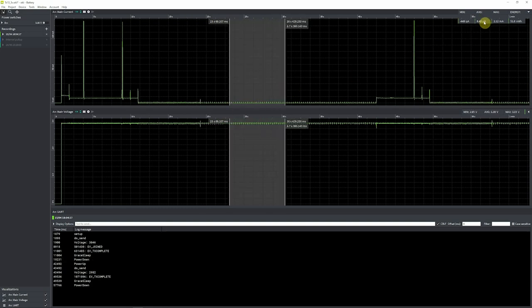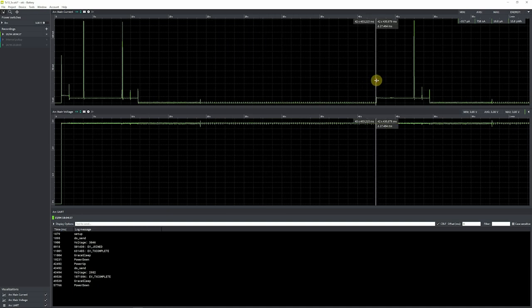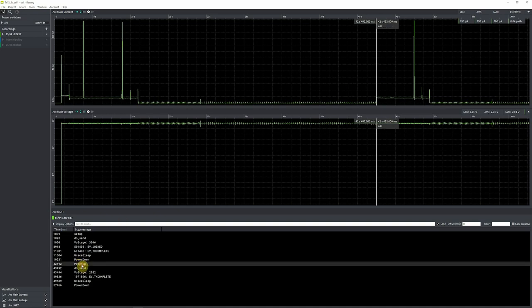This is where we achieve the lowest current consumption, about 8 or 9 microamps. That is pretty good. Now the device will sleep until the microswitch is activated or it hits a falling edge. This is what I triggered in this part of the graph. We hit a statement that says power up. The device will measure batteries and send a message.